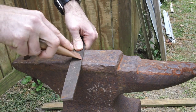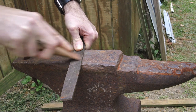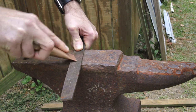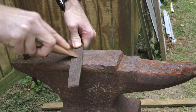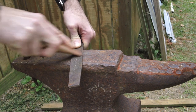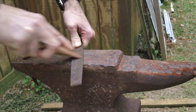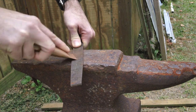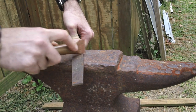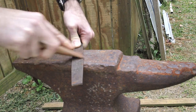If you set it on top of the file and you start it back and forth, it will wear teeth into it and comb it out. And you can just walk on down the file, and get the debris out. You got a stubborn piece, stand it on its edge. Use the corner. Get the stubborn piece out.